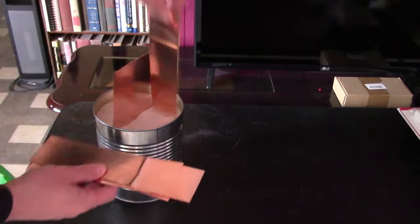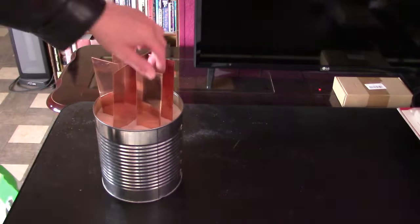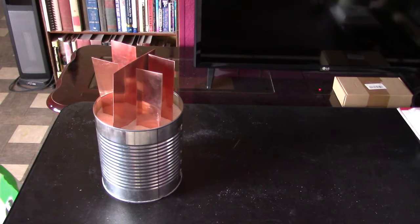As far as the sand battery goes, don't skip the copper — it's super important. Without the copper in the sand battery, it'll only heat the air coming out of the unit for a couple of minutes. You really need that copper to extract all the heat buried deep within the battery.